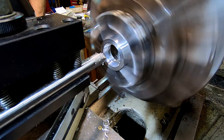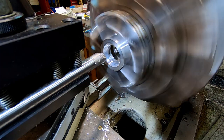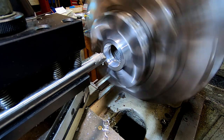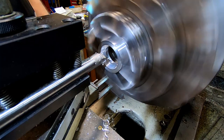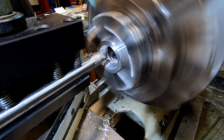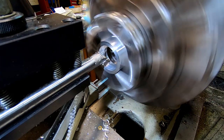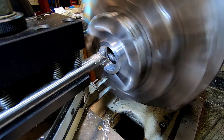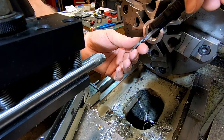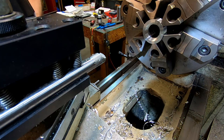There's depth on that cut and I've only got 45 thousandths to go. There's our final cut - we'll run power feed this time. This lathe has got an issue with the power feed - the clutch on the X-axis has got some wear in it, we're probably going to have to adjust it before long. I think it's going to be a pretty major undertaking. 0.375 to that journal.